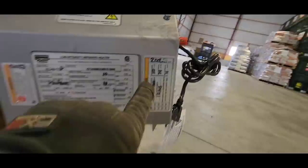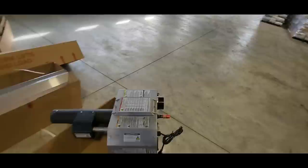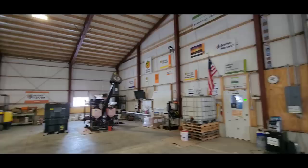Looking at the specs — manifold pressure, 10 maximum inlet pressure. Oh, it says 14 minimum inlet pressure, 11. Sweet, yeah — we're doing that, no question about it. We're just going to up the pressure a little bit. That'll give us the flow we need. I thought 11 was the max; it's 14 that's the max. Perfect. So yeah, that's going to be our plan — we're just going to increase the regulator pressure just a little bit so that we can make the run. I still don't think we can do it with the flex pipe; we still got to use black pipe.